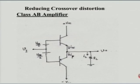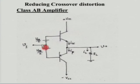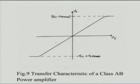In this context, we studied the class AB amplifier, where a very, very small bias was applied to take care of that dead zone. We said this biasing has to be done extremely carefully. We want a situation as close as possible to class B, so we choose a bias very carefully, so that it is just at the verge of conduction, and we get efficiency at the same time without much distortion. If you can ensure that, you would get a linear characteristic and therefore ideally no distortion.